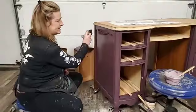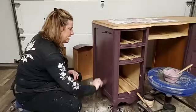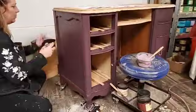I went over my paint horizontally and now I want my brush strokes to run vertically, so I'm coming back to clean it up. I've got great coverage with a really soft hand, feathering out those brush strokes, and then I'll clean up the bottom where it all met — and that will dry beautifully.